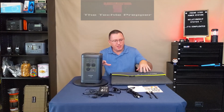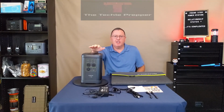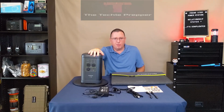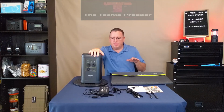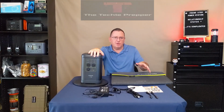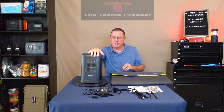Hi everyone, I hope you're all doing well. Welcome to another video. Hopefully you enjoyed my acting in the scene prior to this, or at least were able to tolerate it and get to the meat of the video, where we're going to be covering the FREMO x700. It's a portable power station, 662 watt-hours capacity, 600 watt pure sine inverter output for the AC with a 1200 watt peak. It's LiFePO4 battery chemistry, and it comes with all the prerequisite charging apparatuses and everything that you would expect, and I'll go over those in just a second.